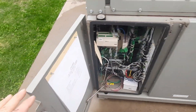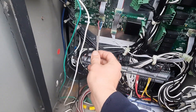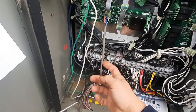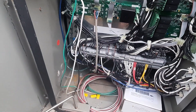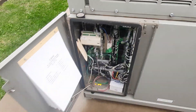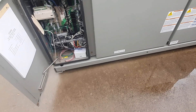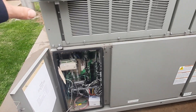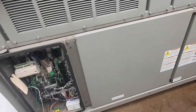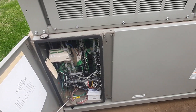It's a rainy day, so I'm going to button all this back up before I go, just in case it downpours. Since all my sensors come back on that one line, if it were a line issue you'd think the problem would be widespread — all sensors reading out of whack. But it's always the suction line temp on stage 1. Tech support said maybe from cycling it's getting premature failure, which I could understand over a longer period, but not 8 months. We're going to check some set points and differentials. Right now I've got no load, it's 50 degrees outside, and this thing is cycling about every 20 to 30 minutes with a cycle time of about 15 minutes.